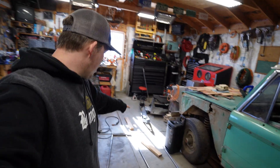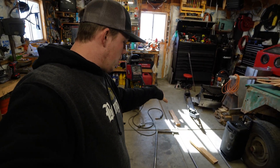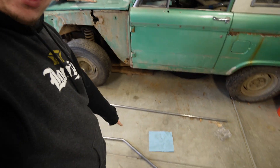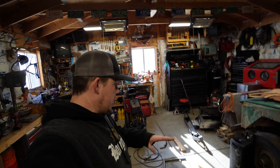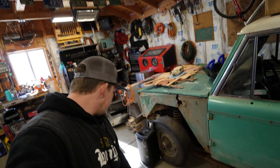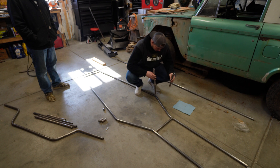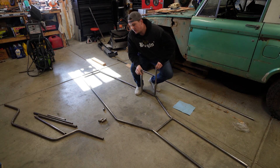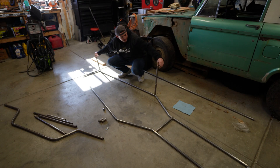On to this next part — I'm going to bend that top rail so that I can get a feel for that. I'm going to find a way to angle it down while making it the same height up here, so I'm going to have to figure out that angle. I think I'm going to go an inch down on each piece and do five of them, starting at 20 inches high in the back and going down to 15 by the time it hits the front, or I'll make some measurements and see if I change my mind. I got my pieces cut out — decided to go 20 inches up in the back tapering down to 12 in the front. I've got angles hole sawed into here — whether or not it's going to work right is beyond me, but we'll get these tacked in and see if the angles are right.